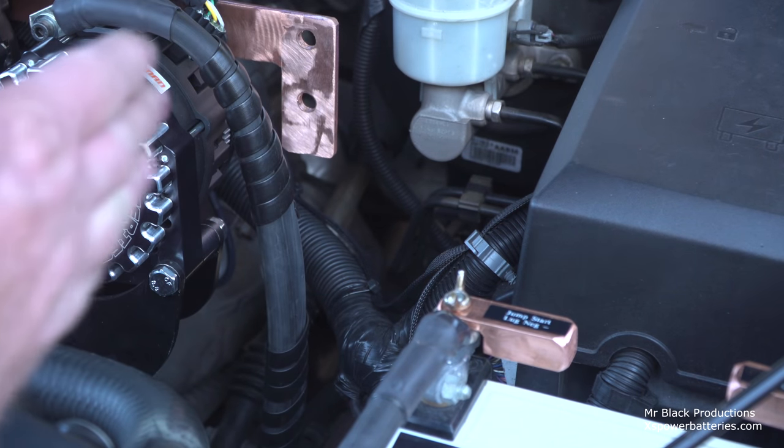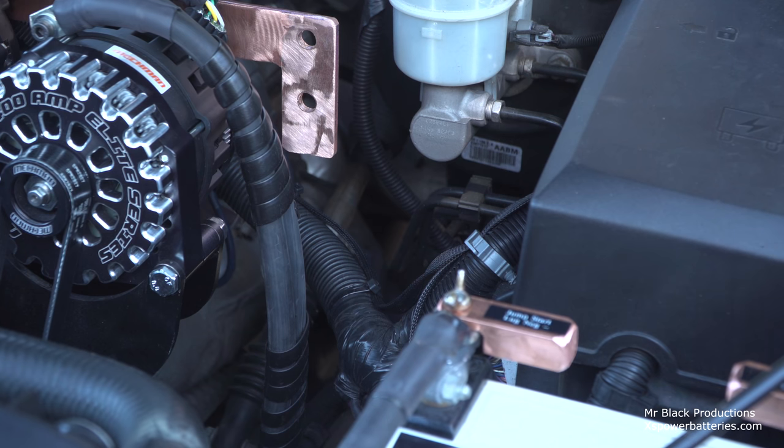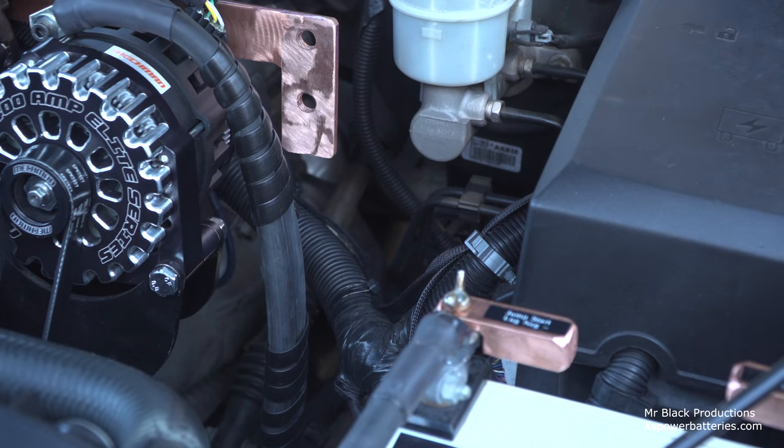So it's the outside of the frame rail into the outside of the car and on the inside of the frame rail. If you get T-boned or get slammed into or the vehicle rolls over, if you are on the outside of the frame, that power wire is probably going to get pinched. Well, because it's mostly fuseless, at least this system will be, you're basically driving around an atomic bomb waiting for it to explode if somebody runs into you. Whatever you do, don't ever take your power wires and run them through your fender well under the door. That's the biggest no-no in installation of them all.